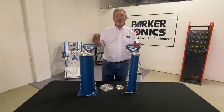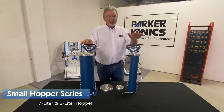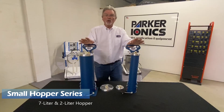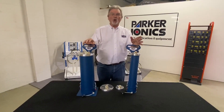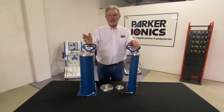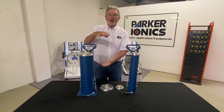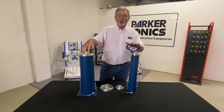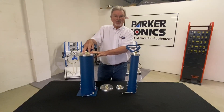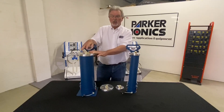Today I want to introduce you to our small hopper series. In this series we have a 7 liter hopper and a 2 liter hopper. You might wonder why we rate them in liters — it's because powder has specific gravities that range from 1 to 2.6. Specific gravity relates to how many pounds can fit in a certain volume. So while this might hold five pounds of a 1.0 specific gravity powder, it could also hold 10 pounds of a 2.5 specific gravity powder.